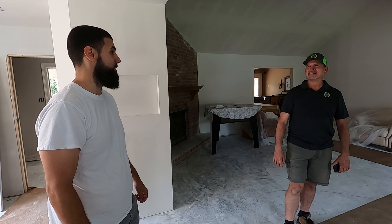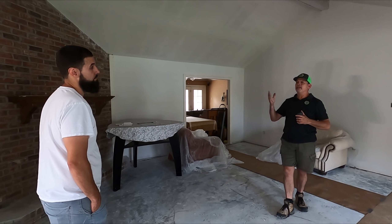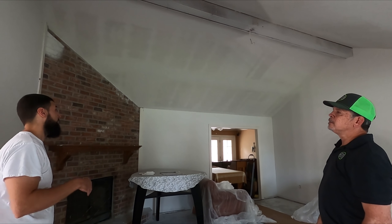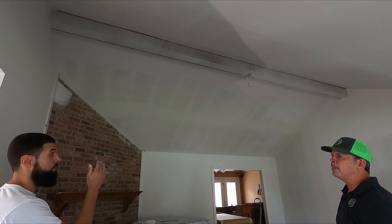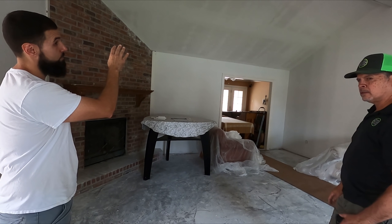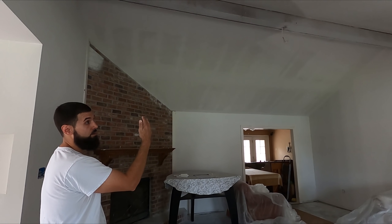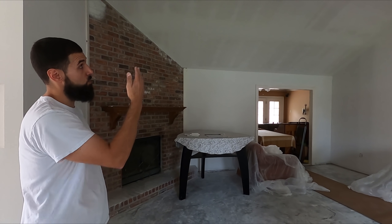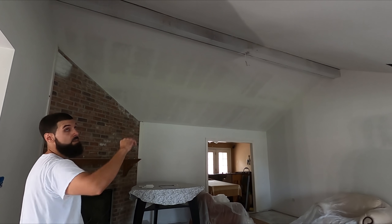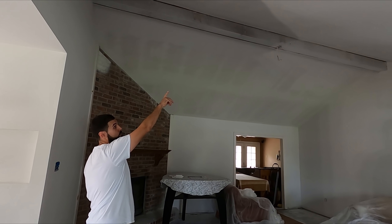You also mentioned that you had to re-nail this whole ceiling — the existing drywall. When you said nail, that made me question: do you really mean a nail? Did you use screws or nails? We used nails, and the reason being, if I go in here and start putting screws it's going to tear it up more than putting the nails. The original framing is not perfect, so I'm going to have a lot more screws trying to pop in this old drywall versus being able to tap a nail in and get it tight — and nail is going to hold better in this situation. It's rare that you'd hear me say I'm going to use a nail versus a screw, but this is one of those situations. On some of the runs up here you literally had six original nails per rafter.